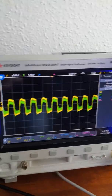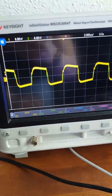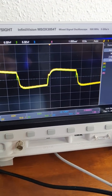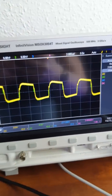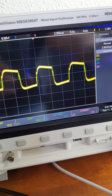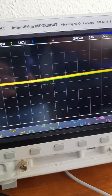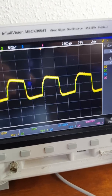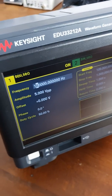50% duty cycle. We've got a frequency here of 180 kHz and a 5V peak-to-peak voltage. This is what it looks like on the oscilloscope. Right now you can see it doesn't look bad at all. What we're looking at is the secondary side — basically what the gate of the MOSFET is seeing. It looks pretty good, with just a small droop from the start to the end, no big ringing. That's definitely a waveform you can work with for gate drive transformers.